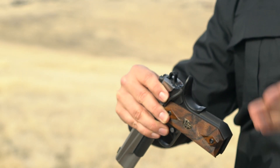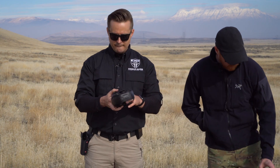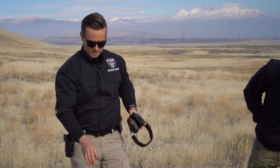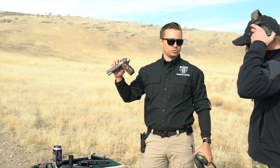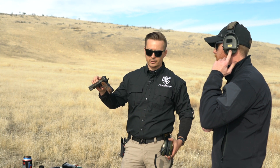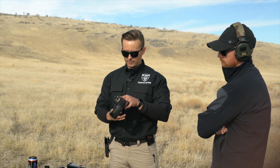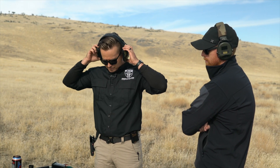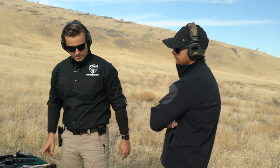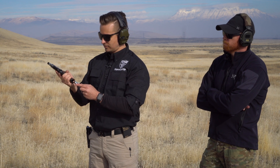Get in tight here on the back — look at that fit. It's seamless. This fit is what other companies would love to have, and I just took a slide off one gun and put it on the other. This barrel is normally fit to a different frame — barrel-slide fit with the lugs is really important — but we just did that. We've got a five-inch slide on a Commander frame.